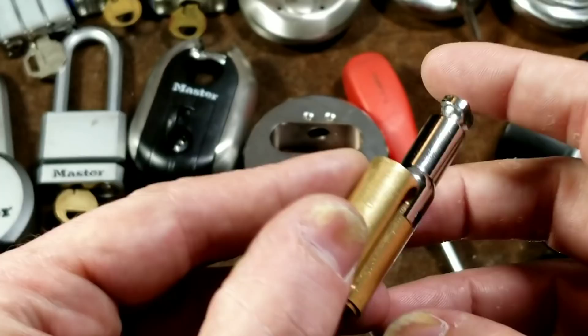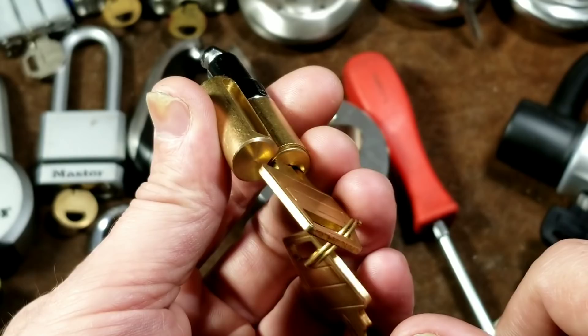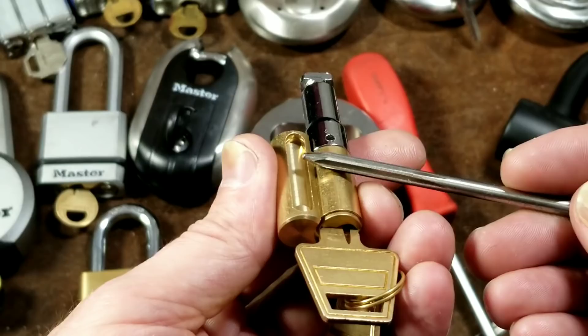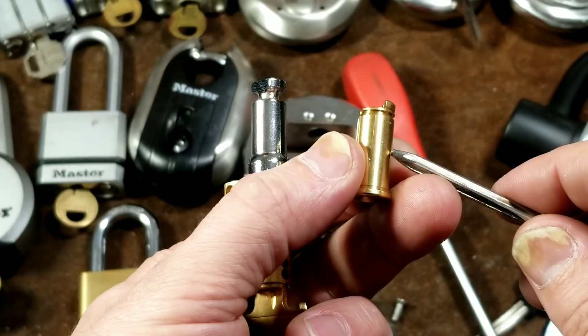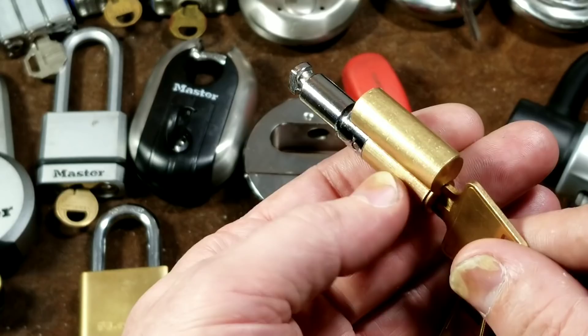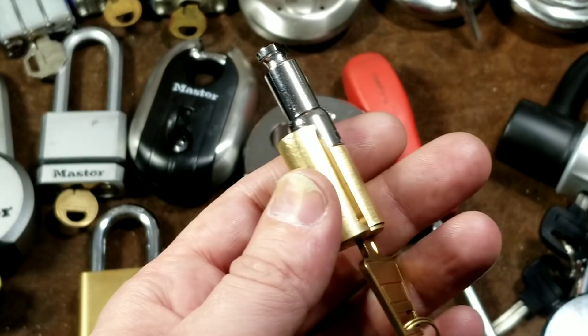Getting to how these things are locked up, it's a little bit funky. They've taken the internal core and milled out the whole right-hand side all along in a groove, but it's like a slot where it still has the back part there — I think just to save brass and make it a little cheaper. On the left side they have a bunch of slots the same way, and you can black-hole yourself: the pins will fall into that slot and you can't get it back together or apart, and the lock cylinder is destroyed.